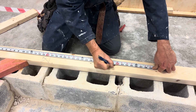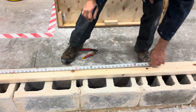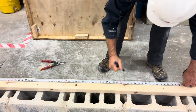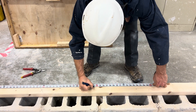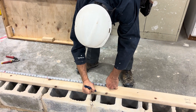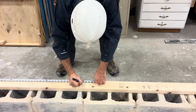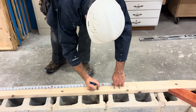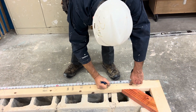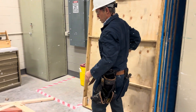I'm going to fall back 3/4 of an inch and put a mark. Then go to the next one — 48 — fall back 3/4, put an X. Go to the next red mark, fall back 3/4, put an X. I continue this pattern — next red mark, fall back 3/4 — repeating all the way down the plate. Then one mark here at the end. Now I have them all marked where I want them.